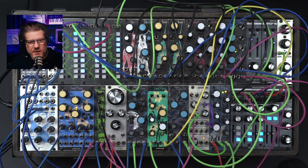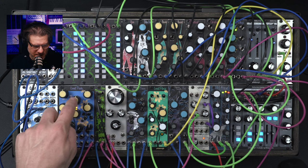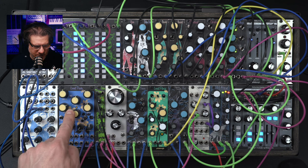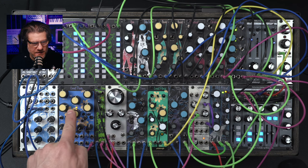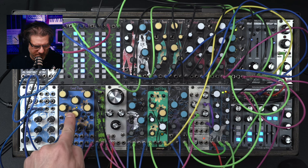And typically, and this is in the SV1 when we did it, we tied the pulse width of the square wave to the blade wave because it saved a knob. We certainly did it that way with the primary oscillator. But this one, being the focus on square waves, they're two totally different circuits. So the blade wave kind of stands alone in here. This does have an LFO built in, a modulation source, because all the stuff in here, you kind of really need it. So the LED you see is the LFO portion of it.